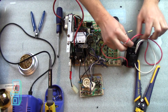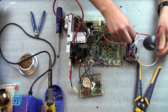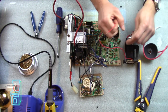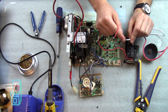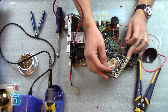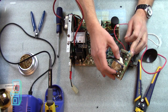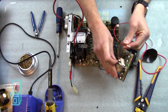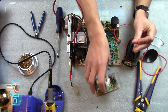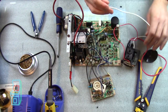There's a really thick one here which actually connects to the anode cup right here. And then you have the last one, which is coming out of the top, which goes to the actual neckboard. And we're going to switch that out and solder that on there. There are all different kinds of neckboard adapters. This one you have to kind of snap off on the sides and then you have to solder the pin right onto there onto this wire. Others just kind of pop off. We swap them in there and just push it back together.